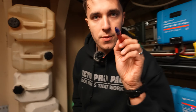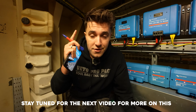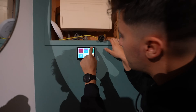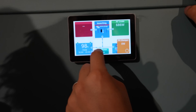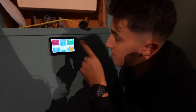Now that will be showing up on your VRM portal. So when you click the link, you can go track this whole install — you'll be able to see exactly what the solar is generating, exactly what state the charge of the batteries are at, and exactly how much that wind turbine is generating. So you can make your own mind up on whether or not it's worth doing. This is the monitoring screen for the Cerbo GX. The sun has gone down now so there's nothing coming in from the PV. All 75 kilowatt hours of batteries are charged to 98%. We've got someone working on the back end with Crestron and a couple of different smart home systems to see if we can pull that into some smart home apps so you can properly track it from your phone when you're away without having to log into VRM.